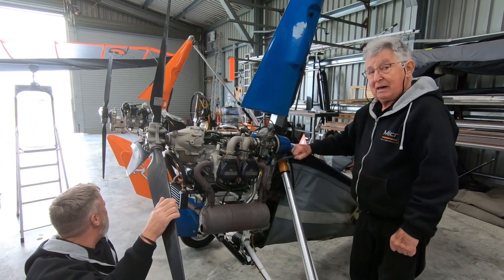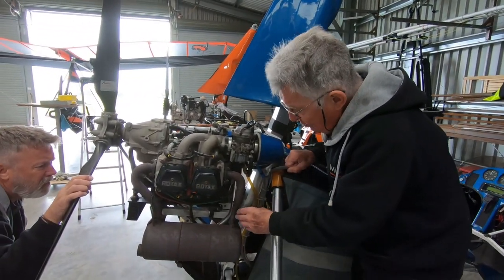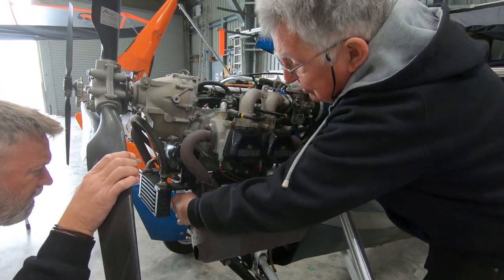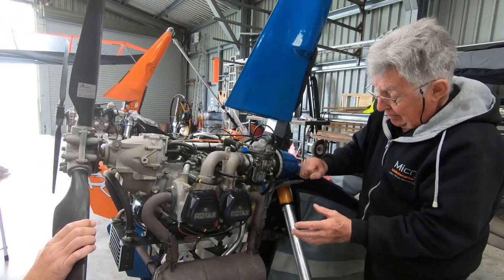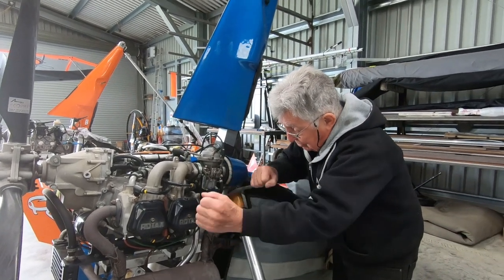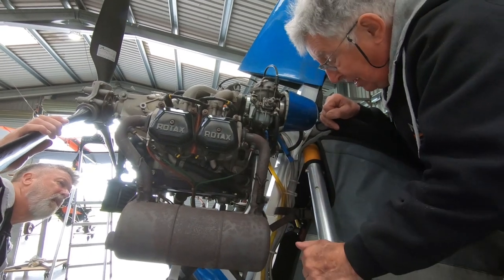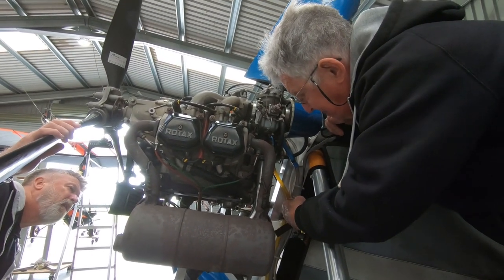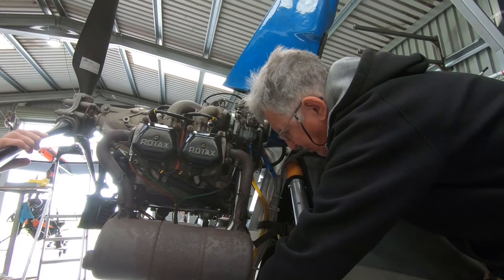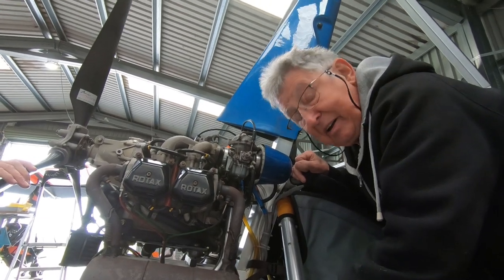What are you looking for, Alan? I'm looking at this — it's an old cradle, an old design cradle, which you identify by not having some gussets on the front here, which were put on to stop the cradle cracking. So this is the old style one, but nevertheless, with it being twisted, I'm looking for cracks on the support structure which has allowed that to twist. At the moment there's no cracks evident, but that doesn't say that they're not hiding in some way. It's difficult to see — there's a line around that weld, but whether that's just a dirty line or whether it's a crack, we'll have to investigate.